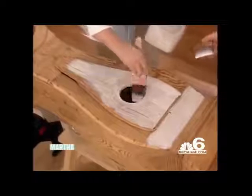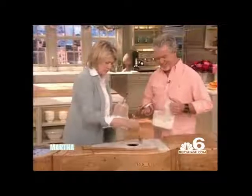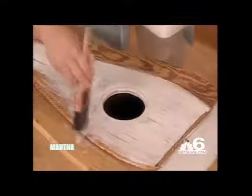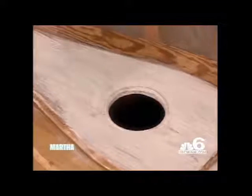Well, now the problem with milk paint is the conditions. Do you call them snot noses? Drips? Milk paint dries really fast. In the conditions, if it's hot out, it'll dry incredibly fast. Is it too thick? See, it's drying. No, but end to end. Get to the end. Okay, I will. There you go. With milk paint, if you don't do it right, people will see the flaw. You're a good teacher. You want to hide it.